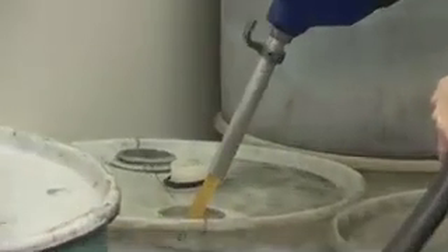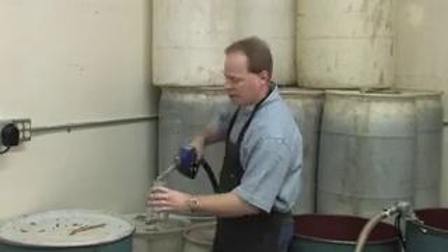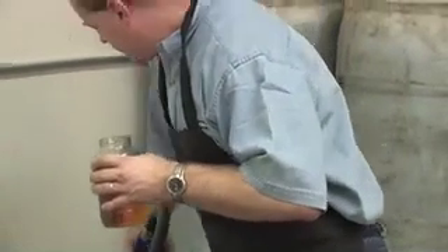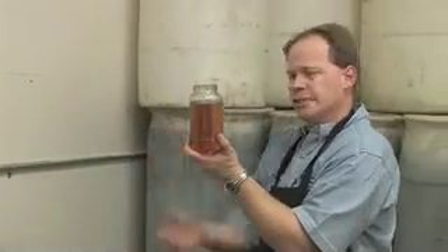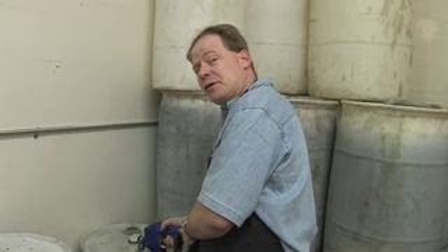We're going to fill this barrel and another barrel all the way full — this can actually be put right to a vehicle. The fuel that comes out of these BioPros is so incredibly clear that I'm going to take this glass jar and put a little bit in it, and you'll be amazed at how clear this is. This looks cleaner than most diesel fuel. One of the benefits of using this is I've made this fuel for 96 cents a gallon, and then I get it turned around and claim a tax credit because I use waste vegetable oil to make it. I'm making fuel for 46 cents a gallon. That's pretty darn cool.